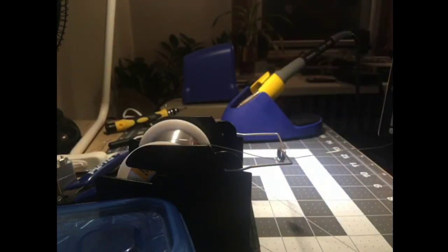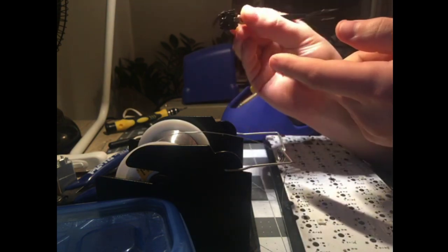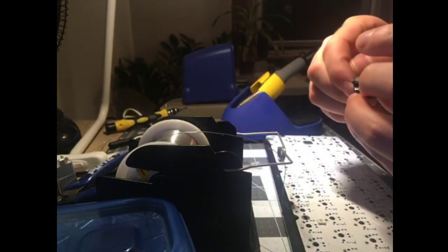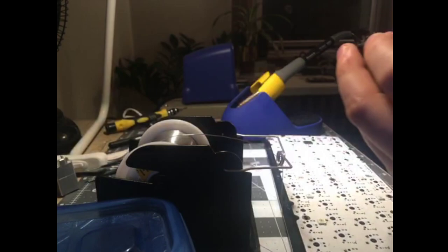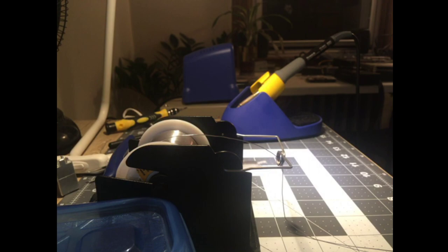The DIY switch puller. This tool is amazing. I love it. So this pin can't see anything, damn it. The pin's folded flat against the bottom of the switch. You've got to unfold it. Sometimes I use the flush cutters to get up in there under the bent pin and unbend it. Goes all the way on the left, which we concluded earlier.